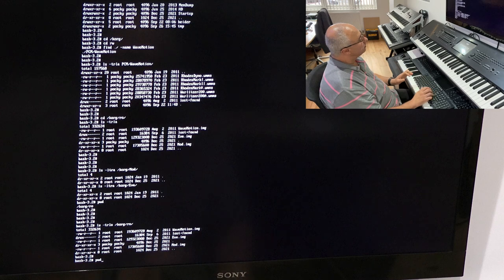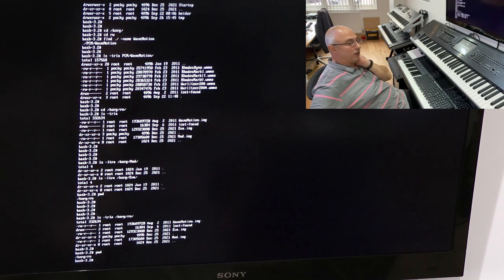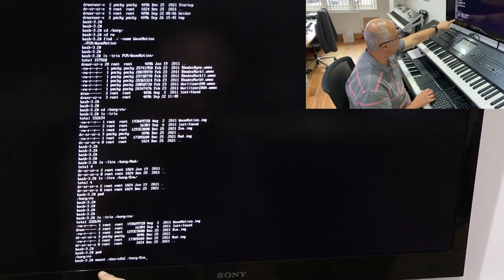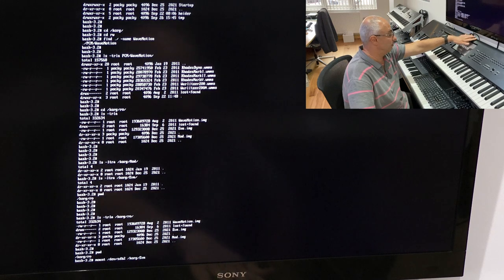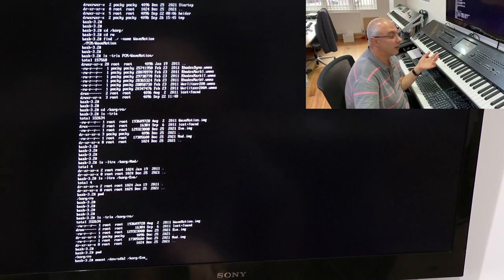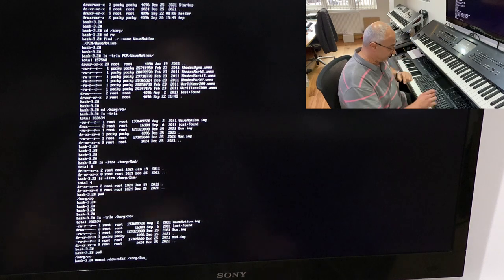Anyway, to do this, you need something called a mount. If you want to open up a device, you would mount it. So for example, if I wanted to mount my /dev/sdb2 onto, say, /korg/EVA. Notice that in the past, EVA was blank. I have two hard drives in this system: the original built-in SSD, 30 or 60 gigabytes, I can't remember, and another SSD with 1 terabyte inside. The sdb2 is my second hard drive.